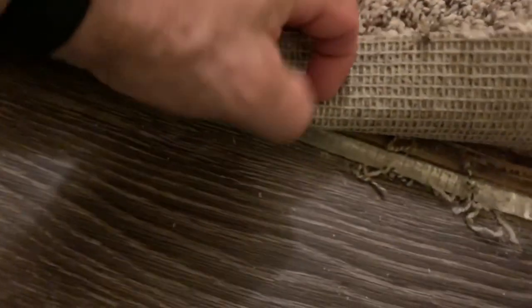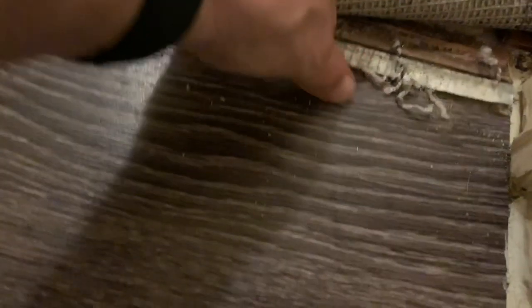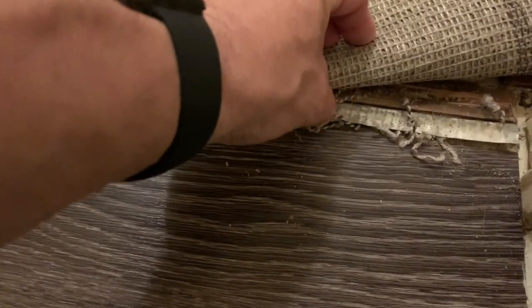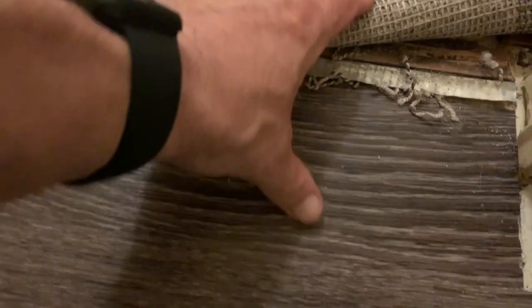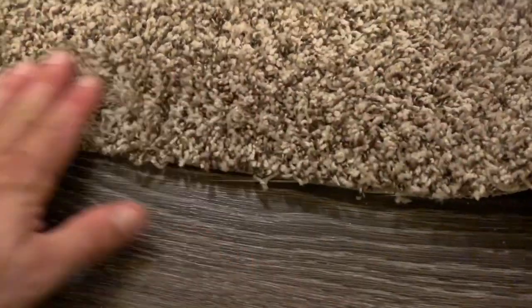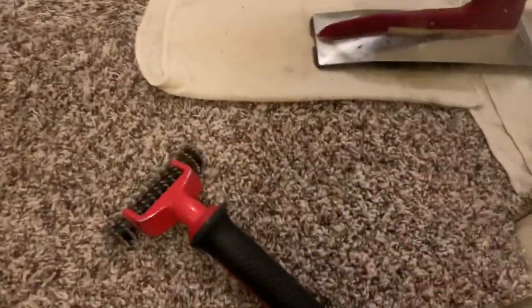It's got everybody's favorite z-bar, but this is where z-bar should be right here — this is what it's made for, for this type of transition. It's a vinyl looking wood surface. Z-bar is for exactly this: when the carpet is higher than the surface, you put the z-bar there so you can cut the carpet and wrap it around it, then hammer it down. That is the proper use of z-bar. I wish more people would use it in the right place and quit putting it everywhere, because it sure makes it look bad and makes it very difficult to work with.